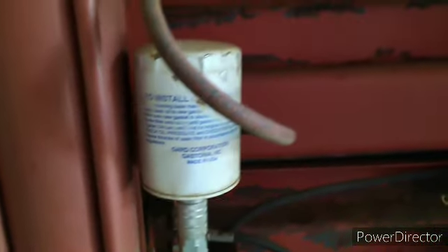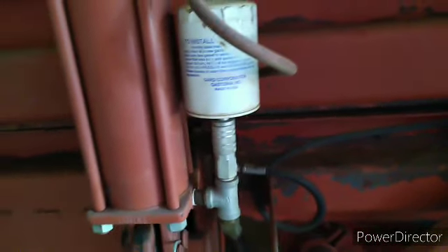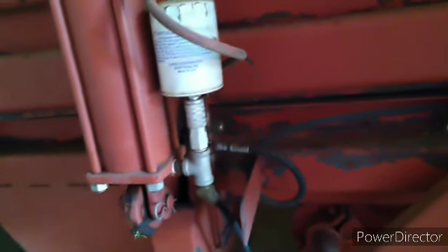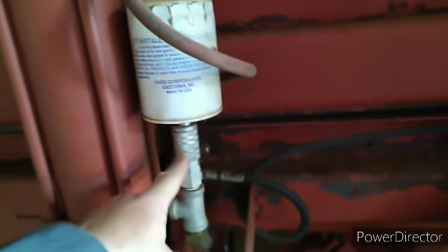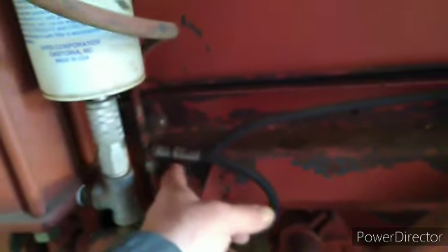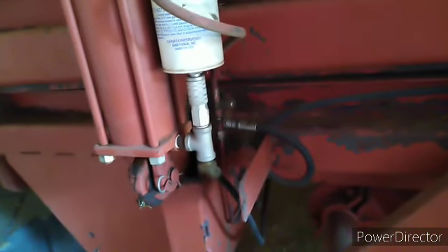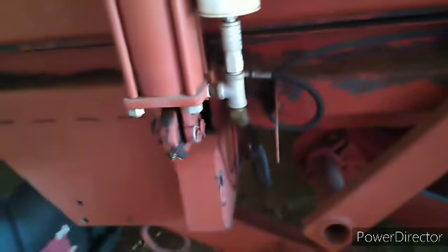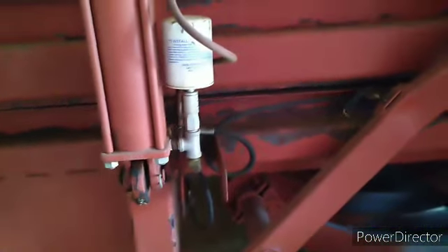This is not factory, obviously. Originally there were two little tiny plastic breathers, one on each side, and we changed that because the breathers were always full of crap. Now there's a half-inch air coupling. The only way to get these backed off — you can't just put pressure to it — you break the hydraulic line loose, and by putting air to here and using the ball valve to meter how much you're pushing, you can shorten those cylinders, but you lose about a gallon and a half of oil. That's what we did for a long time.